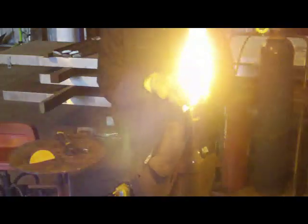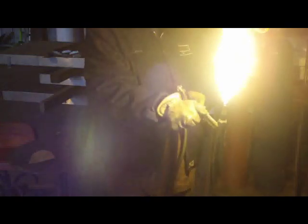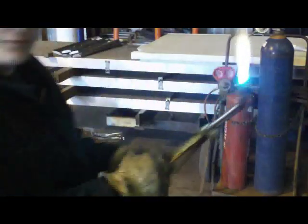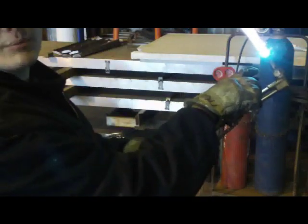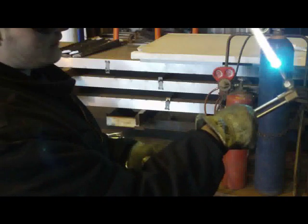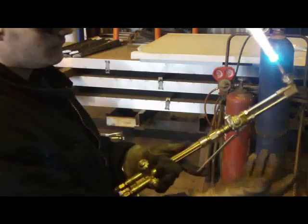What I like to do is bring the flame just so you see it's touching here — get a little gap right about there. Now crack the oxygen valve slowly. Keep opening the fuel valve until it's open, then keep opening the oxygen and balance it. As you can see, it's a nice sharp bright point where the flame kicks. Pull the cutting handle, and now dial it in to the brightest, sharpest, cleanest-looking little blue flame at the center. There you go — we're ready to cut.